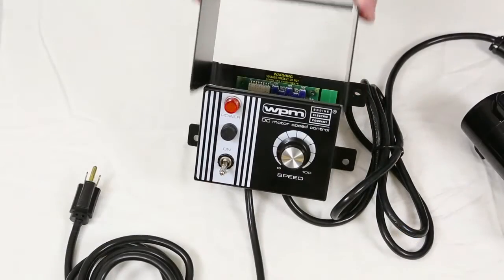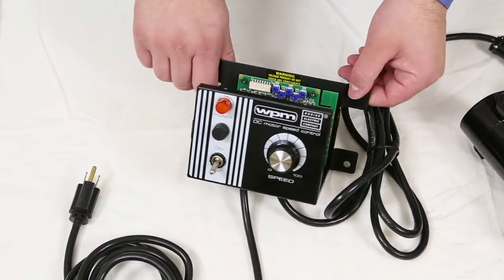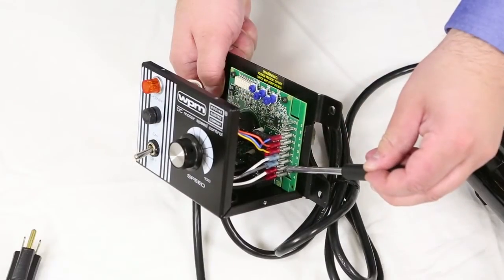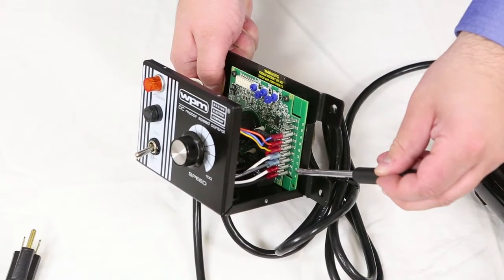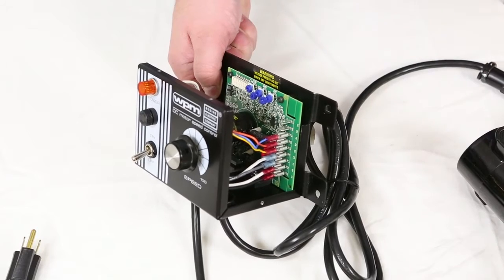If running the motor, you find that the motor is spinning in the wrong direction for forward, you can lift the terminal box cover of the control unit and look for the A1 and A2 terminals. Swapping these two power leads will reverse the direction of the motor.